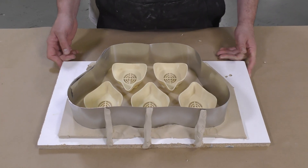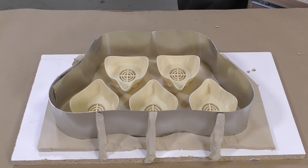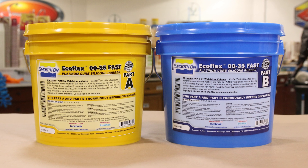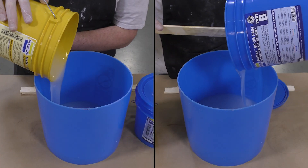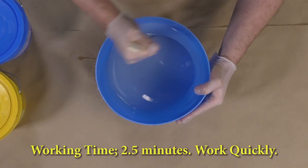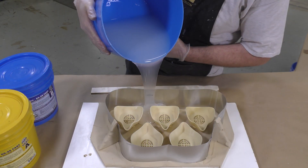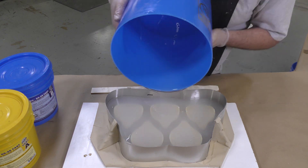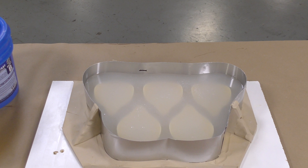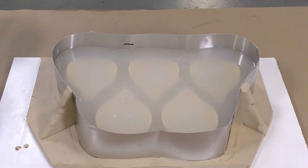Because this bigger mold is quite tall, I'm going to add some buttresses on the side to support the aluminum shim. There should be at least three-quarters of an inch of material or space between the models, so there's enough material to support the structure of the mold without deforming the castings. We're using the Ecoflex 0035 Fast — this is a fast-setting material, and even with almost a full gallon, I still need to mix it fast and get it into the mold box. Scrape the sides and bottom thoroughly. Pour the material in one single spot and allow it to seek its own level. Do not swerve around pouring material all over your model — just allow it to rise naturally. Allow five minutes to fully cure.